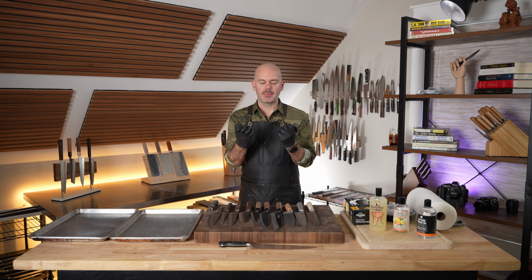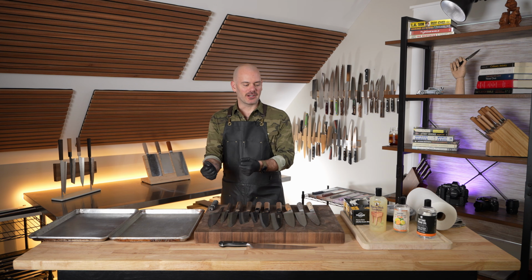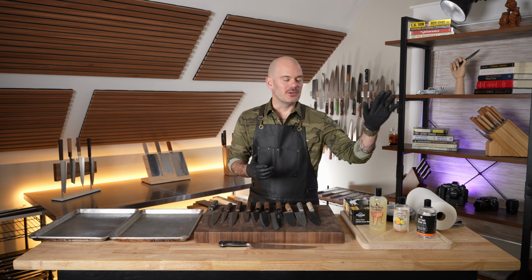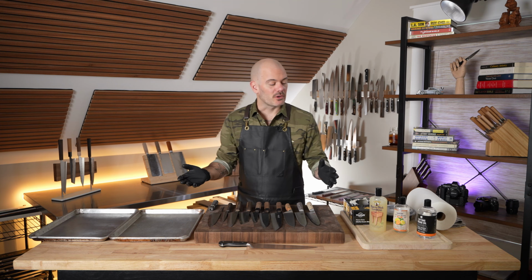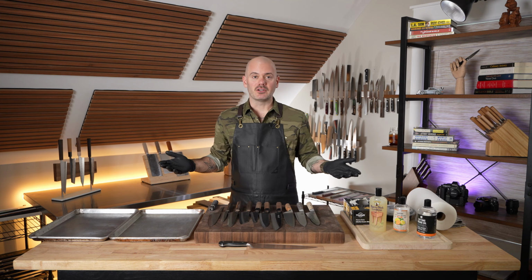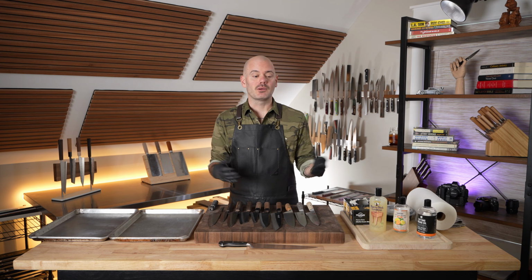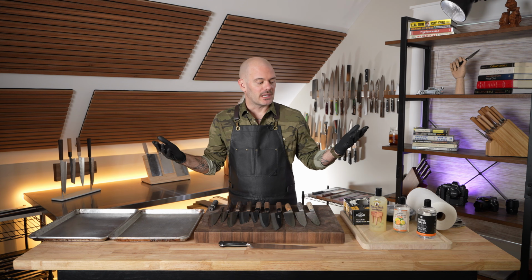There's something about a natural wood handle, there's a warmth to it that you can immediately feel the difference when you pick one up that is lacquered. So all you're gonna do is take some food grade mineral oil. You can get it on Amazon, you can get it in most grocery stores, home improvement stores, and you're just gonna rub it on your knife, let it sit overnight, and you're good to go. That's it. If it doesn't absorb, well, there's some lacquer on there. Just wipe it off with a paper towel. No harm, no foul, you gave it a go.